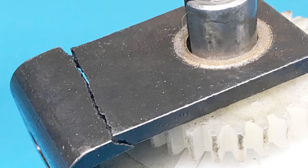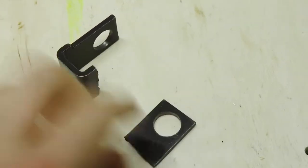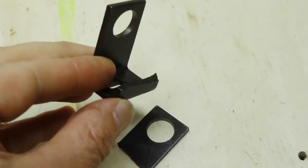After doing that, I put a drill bit in — I thought I'm going to drill a hole, now it's finally working. I brought the drill down to the work, and as soon as the drill touched the work, the cogs disengaged, the motor spun around, but the drill bit was not moving at all. I discovered that a part called a gear fork, which holds one of the cogs and lets you switch from low gear to high gear, was actually cracked. Great manufacturing quality there as well. I got a replacement and fitted it — quite easy to fix, it's all Allen keys and Phillips screws.